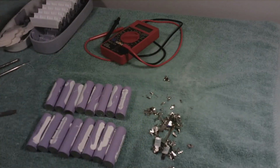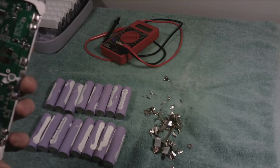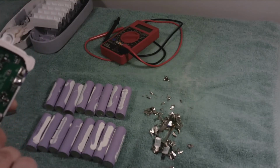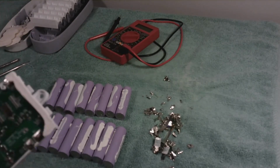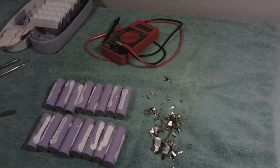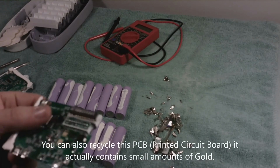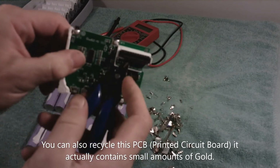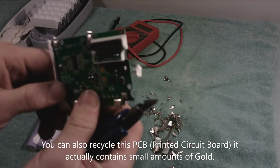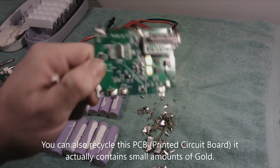And so that's the idea with these batteries too, is you want to overbuild your battery if you can. You want to make it way bigger than you need it to be so that you only have to use it a little bit and they last a lot longer, and then it's always there if you need it. So the LiFePO4, the lithium iron phosphate, this is another example of where that chemistry really shines. It has an estimated life cycle of 5,000. So 5,000 life cycles, and it's supposed to still be at about 80% of its battery life at that point. That's pretty intense. On top of the fact that it's almost impossible to explode or catch fire, that sounds great to me. Now the downside to that is they are more expensive, and they take up a little bit more space, but I'll get into that in a little bit.